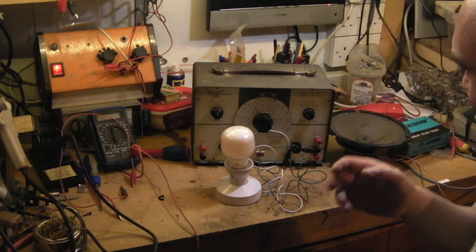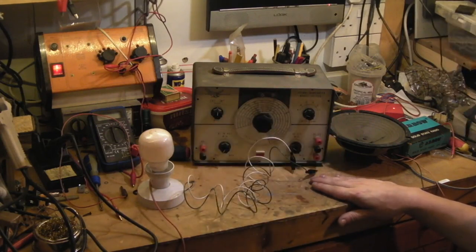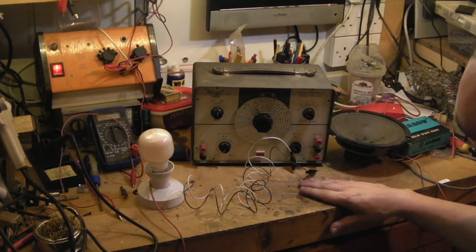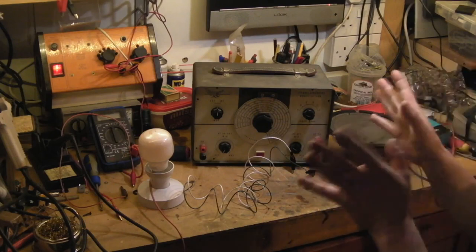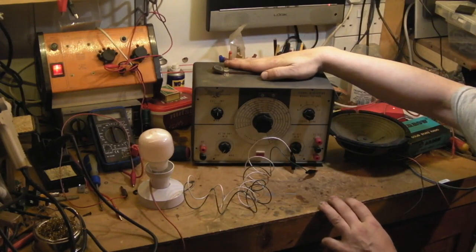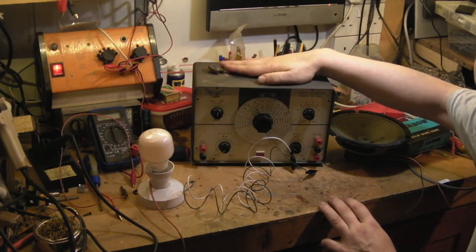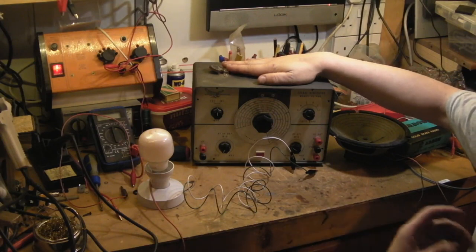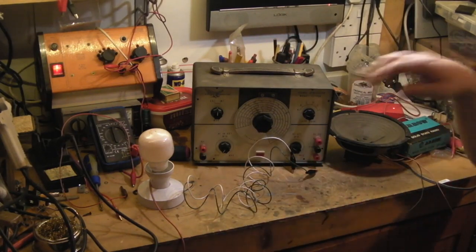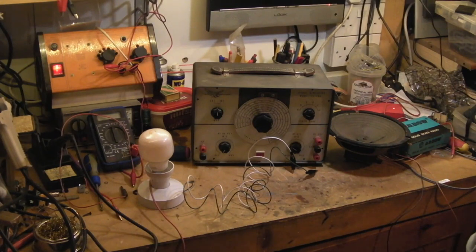Like I said, I will not get back to this now because I really want to get back onto the Apricot project. But I think we will revisit this — we'll try and figure out why the AF output isn't working, we'll probably replace some of those capacitors, test the valves, and make sure they're in good condition. Changing that double triode valve for something else could affect frequencies and require realignment, so fingers crossed it's in good working order. When it's sorted out, it's going to make quite a nice piece of test equipment alongside my Advanced signal generator — a nice addition. Anyway, I'm going to leave it there for now. I hope you enjoyed this little video — thanks for watching and goodbye.